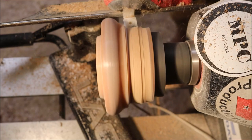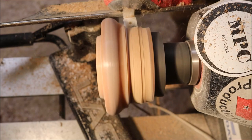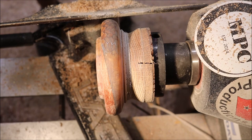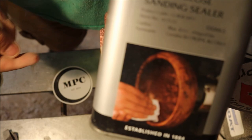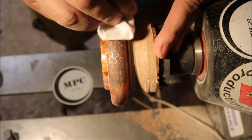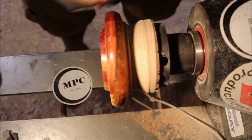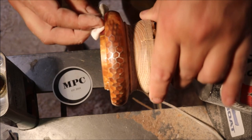I used that thick set for that. So now it's uneven. How the heck did that happen? It must have bent the screws that are in there. I've got to sand it up to about 400. A lot of people ask why I put this on my resin also. Well, this cellulose sander sealer gets into the little scrapes that are there from sanding and it helps to fill those also. People are like, what? But it does.